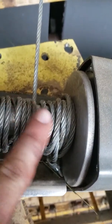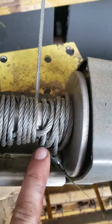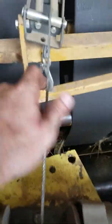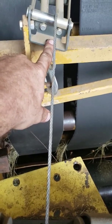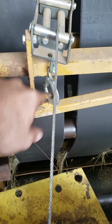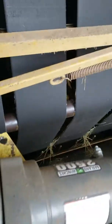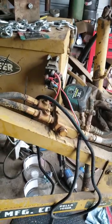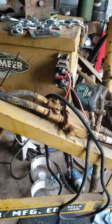I got that on there and I'm going to grease it up pretty good over the next day or so, and hopefully get in the field and roll some hay to test these wheels out. I did lower the pickup just a little bit by that tension spring right there, and if I need to I can raise it back up — no big deal.